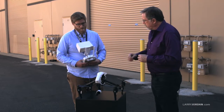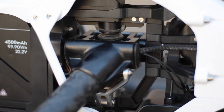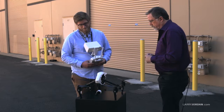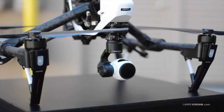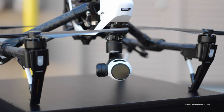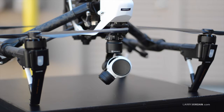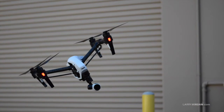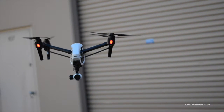The central housing holds the battery in the back, and the rest is just mechanics and structural integrity. The legs lift up and down — we'll see that in just a minute. The camera is on a three-axis gimbal, which keeps it steady no matter where you're moving. With a second operator and another controller, you can have them controlling the camera to move a full 360 degrees all the way around — it tilts up and down, and sideways. For a cool effect, there's a locked-off version where it stays perfectly straight with the telemetry of the drone, so if you turn, it turns and looks like you're flying a plane. Typically though, I keep it unlocked so it's as steady as it can be.